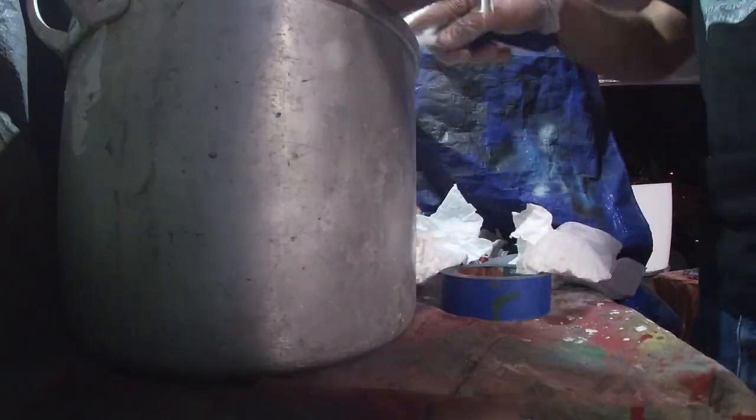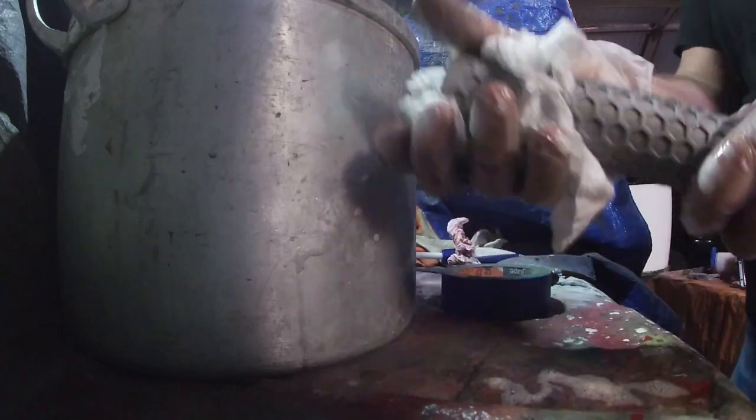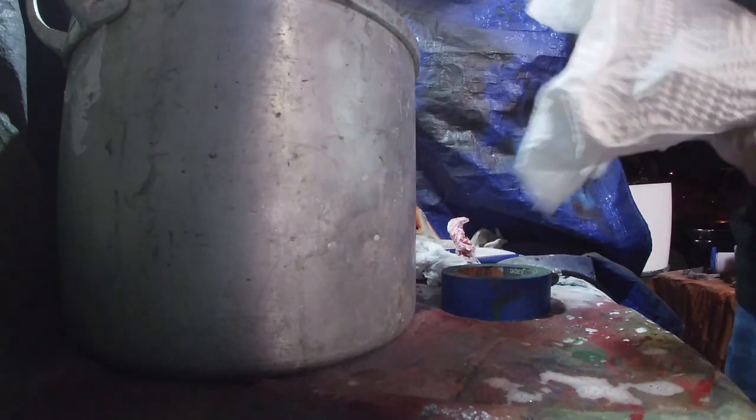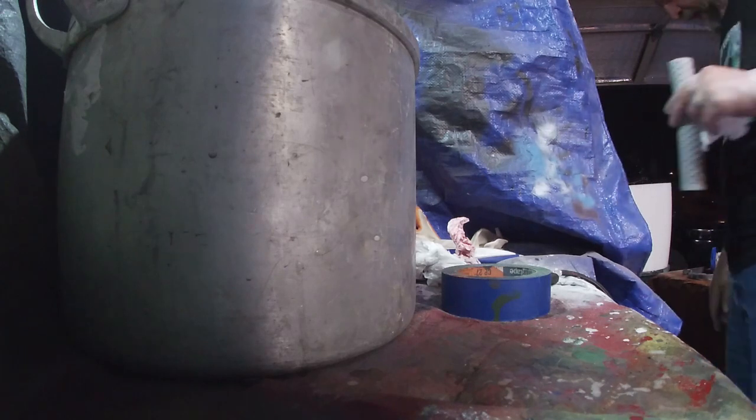Once we've completed the process of sanding off all of the existing color, dust, dirt, and oils from the tubes, the next stage is to do a quick dry cleaning, which is to just dust off all of the existing sand, dirt, and grime left from the sandblasting process. When that is done, we move on to scrubbing the tubes with a cleaning solvent to remove any additional sand, oils, and dirt. The tubes have to be extremely clean and dry in order for the Cerakote to adhere to the metal, and everything at this point has to be done with gloves on to prevent oil transfer.